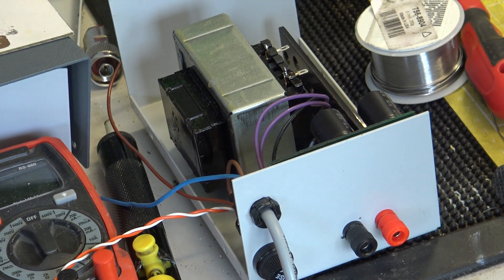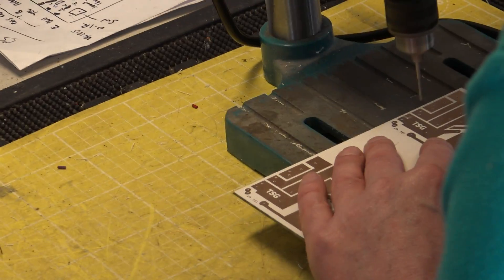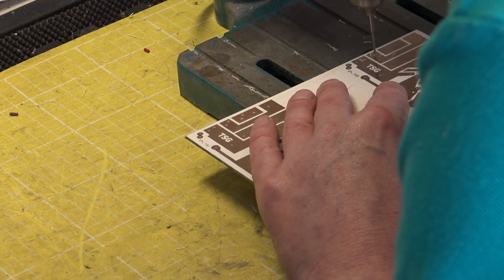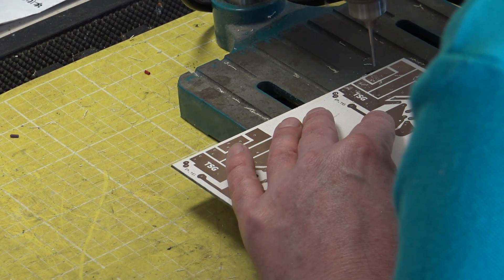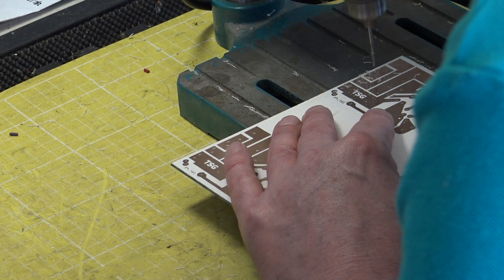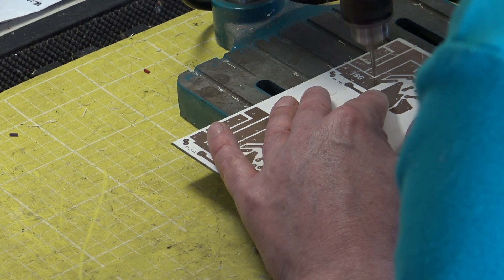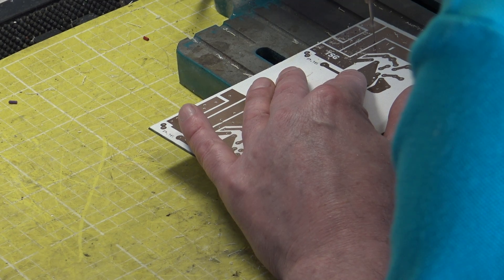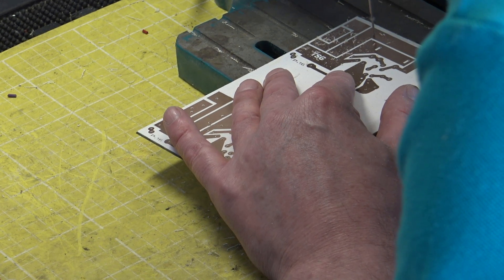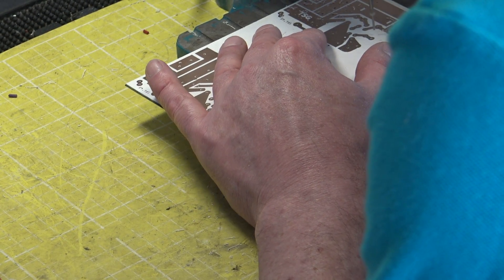The next day, and I'll get Mr Chippy to show you where he is with that power supply. He's just drilling some more boards for some of the other power supplies — just for a laugh. He's gone through with the one millimetre bit, now we're on the 1.3 millimetre bit, because the diode wires need to be that bit thicker, and so do the leads which go out to the transistor — the 2N3055 on the heatsink — and the transformer. When you've done those, pick up the power supply and we can have a look at that.